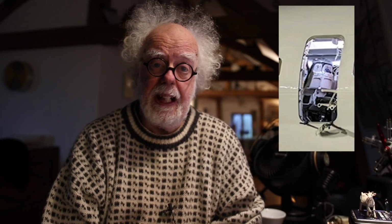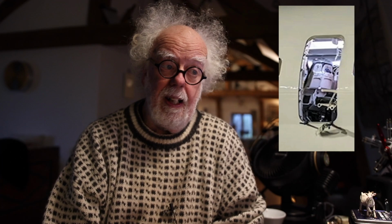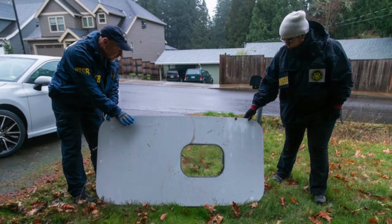So when they pressurized the plane, but they flew it anyway. Not good. What I think happened in flight is right on the edge of the pads holding and the door moving down against the springs, it eventually in the turbulence went poof, separated from the pads, flew out, the springs moved it upwards, it then exited the aircraft to about 20 centimeters. The retaining straps broke, badonk, the door fell down, ripped off the hinge, and here you can clearly see the hinge left on the fuselage and separated from the aircraft, causing explosive decompression, and the plug ended up in this man's garden.